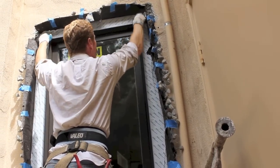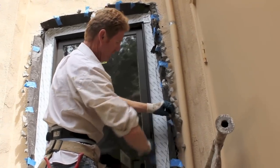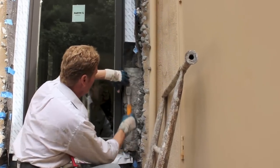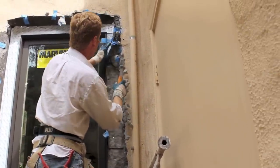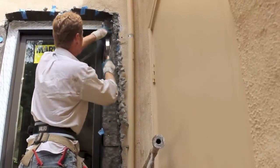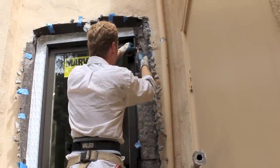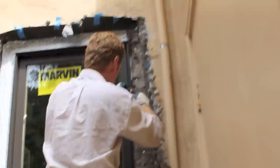We're now covered with the Z flashing. I marked all my pieces out here. Now, two more layers of paper go on this. Dan, grab me a tube of Sikaflex polyurethane caulking, please. I'm going to do this side just like that, then take my utility knife — I'll put a new blade on because I want a nice cut, following the window frame. I'm not going to cut the membrane I just put down; I'm aware of where that membrane is.